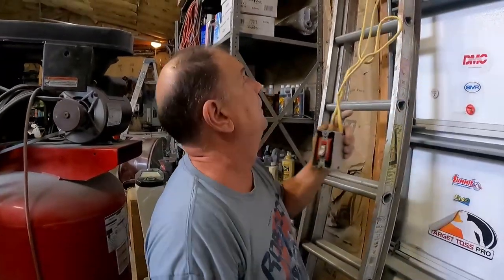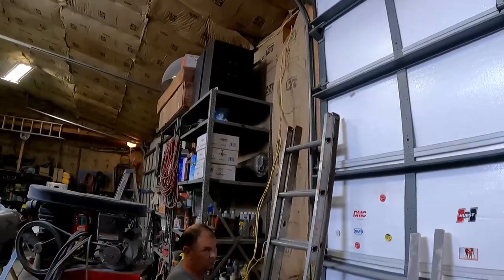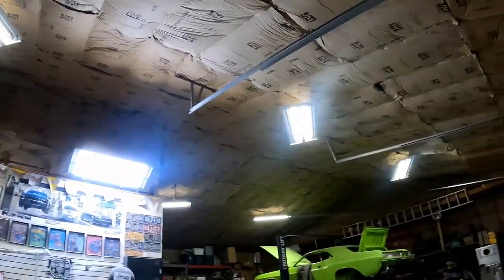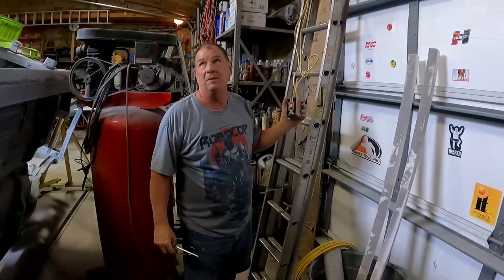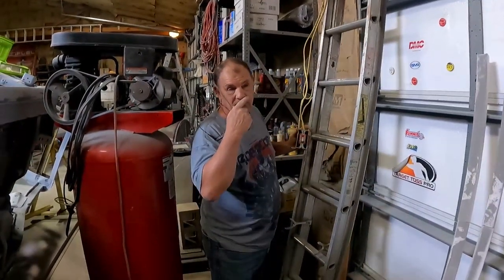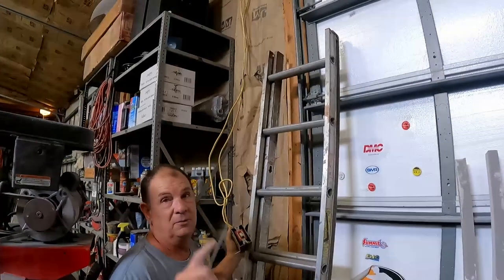All right, what are we doing at Clark's place today? We've taken this switch that was here - it runs our 220 lights up above. There are two strips inside that are 110 and the four on the outside are 220 lights. They're high-bay, high-intensity six-lamp T5 high-output fixtures. This switch was always here for the mercury vapor lights that used to be in this garage, which we got rid of a long time ago.